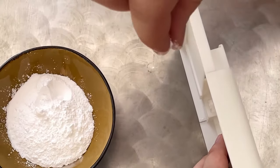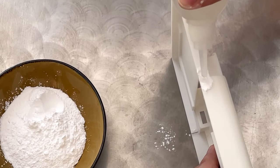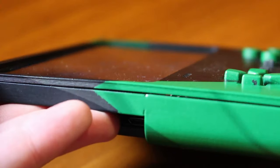Here's a quick tip: fill the seams in your prints with some flour and superglue, or any kind of fine white powder — not that kind — then give it a good sanding. This makes the finish look a lot more uniform. Once it's painted, you can barely tell the two back parts weren't printed as one.